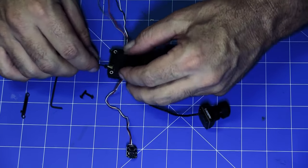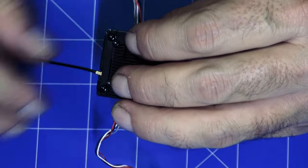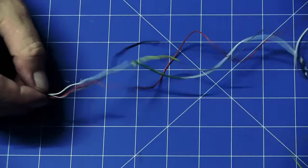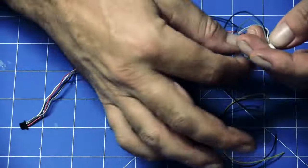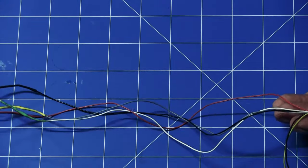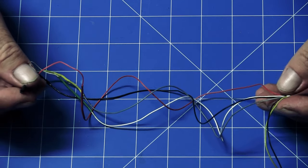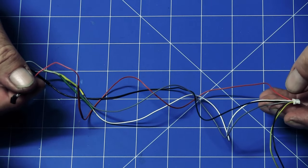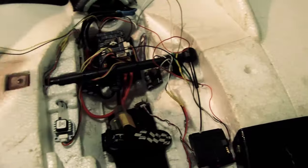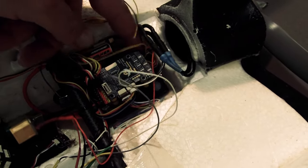So that's the antenna install done — there's a little bit of movement left and right but it can't come out, which is a good idea. Cable is all done. I've got red to red, white to white, gray to gray, and black to black. I'm not too sure whether my RX and TX are crossed — they're meant to be: RX to TX and TX to RX. I'll find that out once I plug it up — it'll either work or it won't. If it doesn't, it's just a matter of swapping it over in the plug, which is not a big deal. She's plugged into the very back corner where the DJI port is.